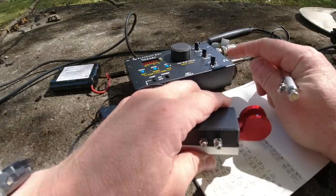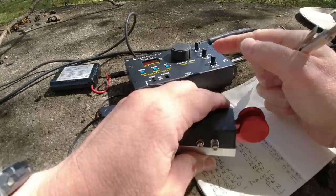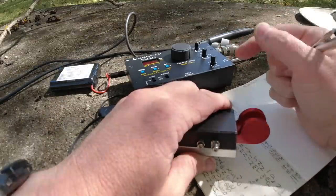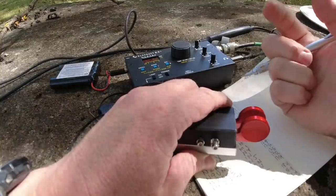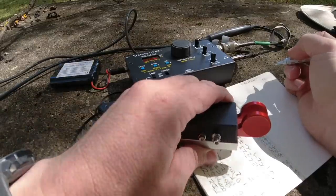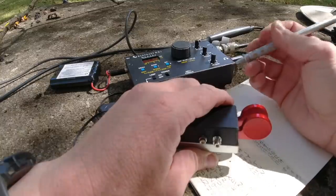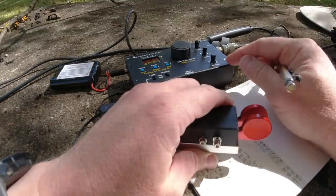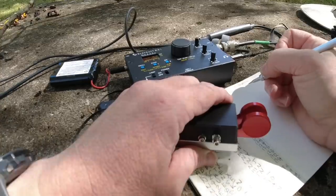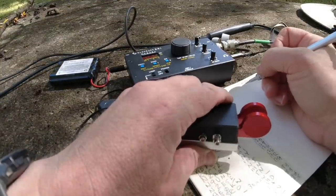So yeah, on radios like the KX1, I don't want the ATU in the mix when I'm on a resonant antenna, because the ATU in this one, if it's on, it's kind of engaged a bit, and it's just not necessary. You want to bypass it to get the most out of your antenna that's resonant. So I just put it in bypass mode, which is calibration mode on the KX1. Looks like I'm getting about 2.25, 2.5 watts here on 40 meters.